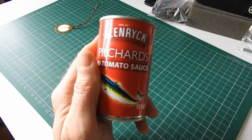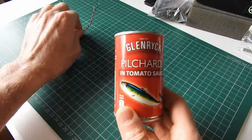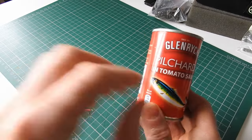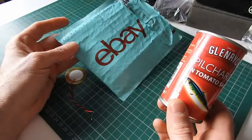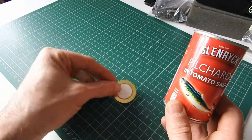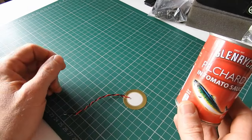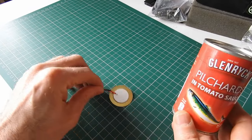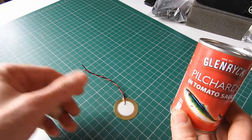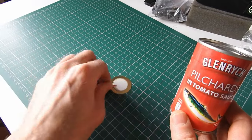In truth, nothing really. However, I recently picked up quite a few of these Piezo contact microphones, a whole lot from eBay. Now, these microphones work by adhering to some kind of flat, fairly hard surface that is resonating, and it will pick up the vibrations in that surface and transfer it into an electrical signal that we can output somehow and hear the results.